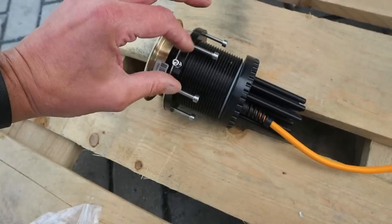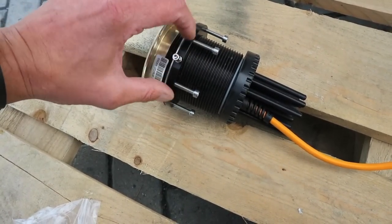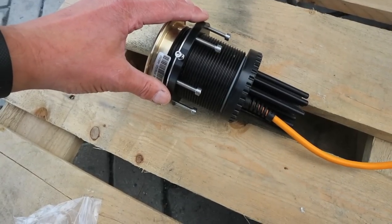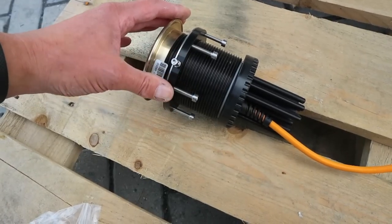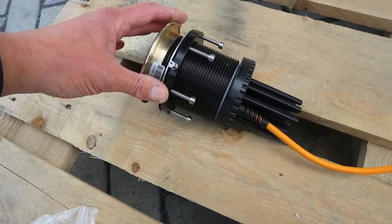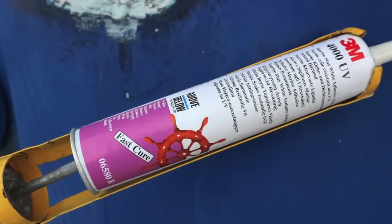The little screw here locks this to this, and then also acts as a bonding nut over the earth system for the boat, and the integrity of the whole system can be maintained as well. Because it's going through the transom, undoubtedly we'll use the rudder stocks which are nicely bonded just to make sure the circuit is continuous. Really important that you use glue that's designed for underwater bonding.